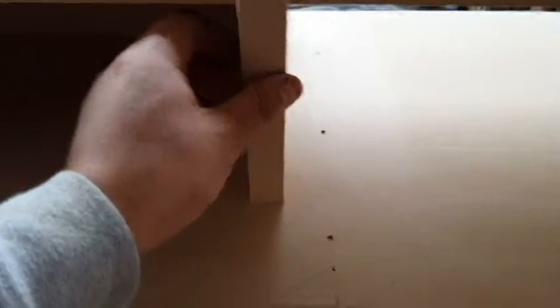I've brought out the entertainment center and cut a bunch of one-inch MDF pieces. I'm going to face the front of the entertainment center with these — centering them in — and that'll give a better, more authentic look. A lot of people use three-quarter inch or one-and-a-half inch face pieces, but since I used five-eighths MDF, I'm going with the one-inch pieces. The longer strips are for the horizontal areas and the shorter pieces are for the vertical areas. I'll go ahead and nail those in place, then start sanding and filling with wood filler.